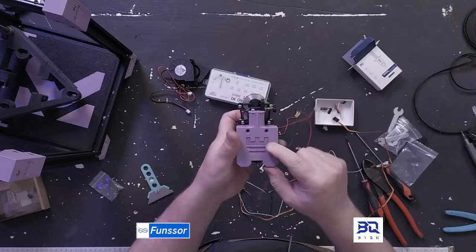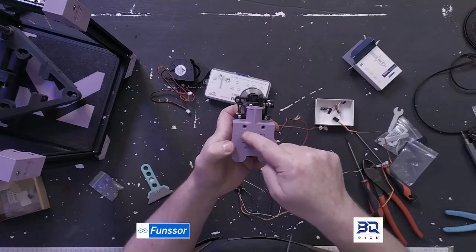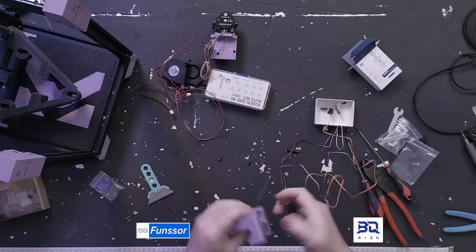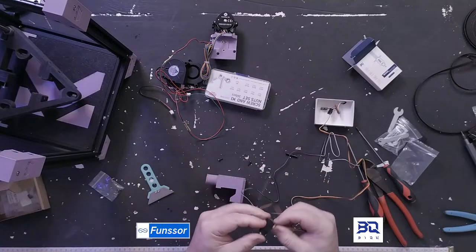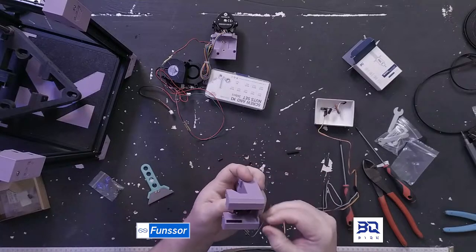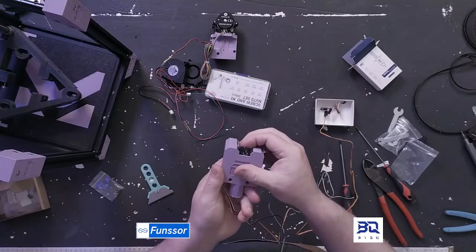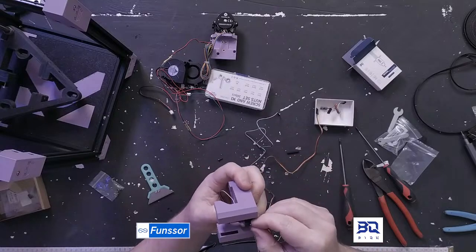But doing CPAP allowed me to have this attached here instead of down here, and then splitting the fan duct into two and having the microprobe right here. So the microprobe ends up there, but inside. I'm attaching the cable for the microprobe, making sure it's securely in there, and then just bending it slightly backwards. I did make a spot for the wiring here. Also, you could flip the microprobe around. There is a spot for your wiring to do that. It just means that you have to look at it, and I don't like that, so I'm going to put it in like so.